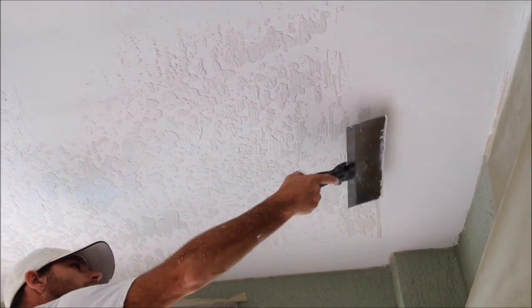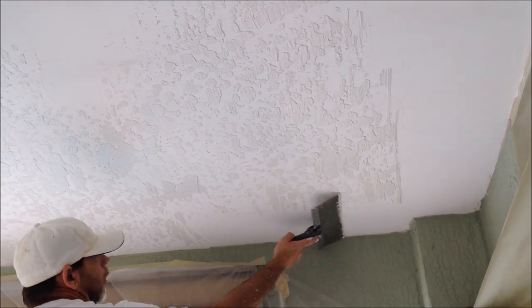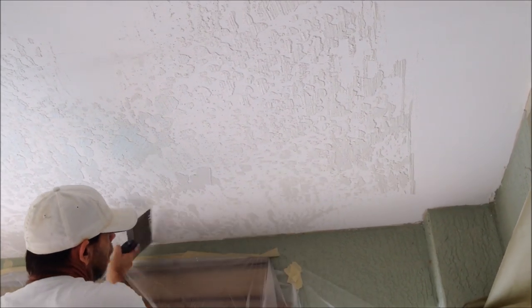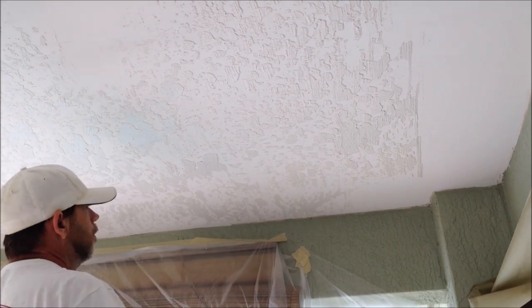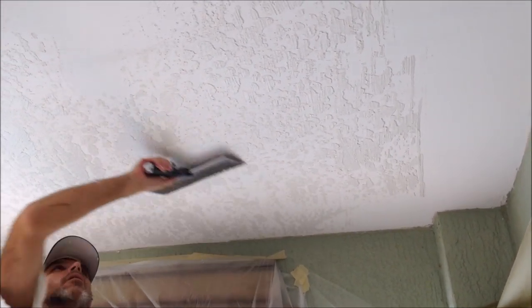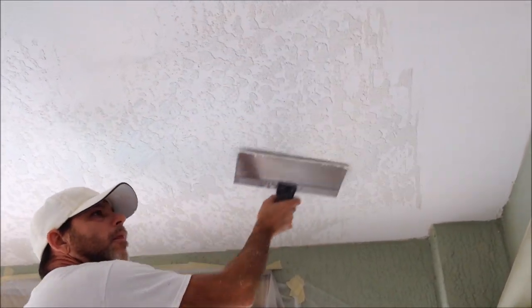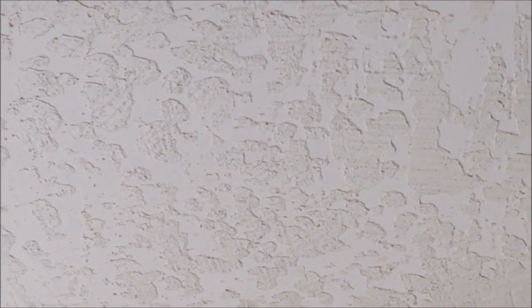Your texture will be unique to you. You don't have to worry about trying to match anything — it's going to match because you're doing it and it's the entire ceiling. I also have skip troweling videos for new drywall. After I've skim coated over a popcorn ceiling, I always try and do a skip trowel texture because it just hides so good. I'll leave links to a lot of those videos in the description as well. What I do is I apply it in one direction and then I knock it down in another direction.